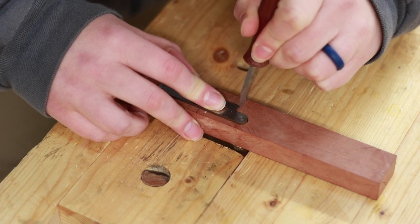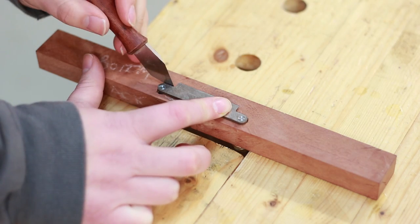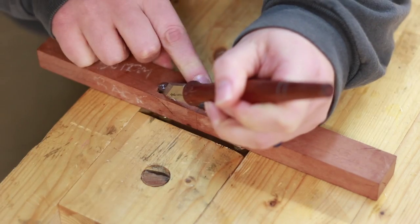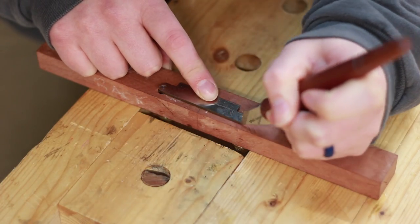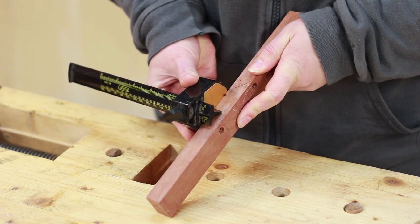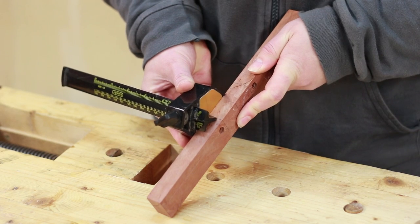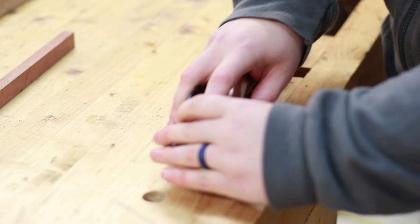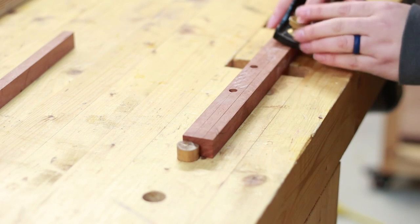Next, the blade needed to be marked out so it can be re-assessed later. This is best done with a sharp marking knife as a pencil would leave too loose a line. After that is marked, more boundaries are known and we can mark for the wear plane. After that was marked, a 3 to 4 degree bevel is added using the block plane.